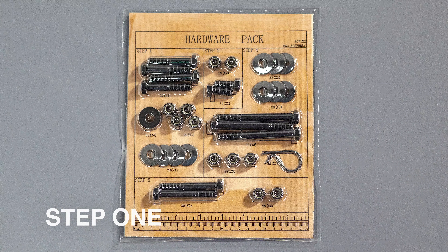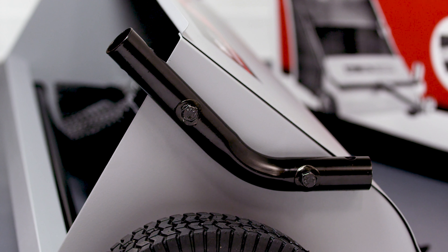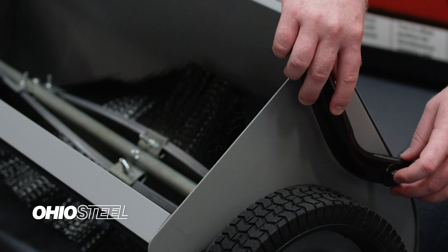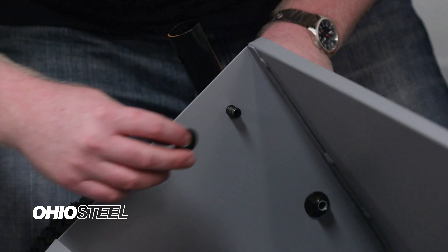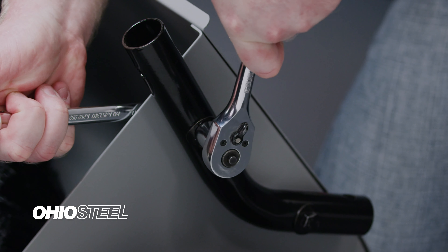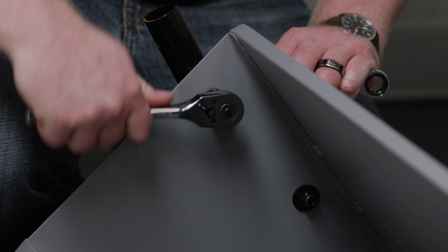Step 1: Locate the hitch mount tubes in the hardware blister pack. Pop out the following pieces of hardware: four two-inch long hex bolts, four curved washers, the group of four flat washers, and four nylock nuts. Please pay close attention to how the hitch mount tubes are oriented. Take the two-inch bolts and first insert through the curved washer, then through the hitch mount tube, and finally through the holes in the sweeper hood. Notice that the longer portion of the hitch mount tube is pointing to the rear of the lawn sweeper — this orientation is essential to functionality. Now hand thread the nylock nuts onto the two-inch bolts inside the hood assembly. Repeat for the other side. Tighten the hardware but do not over-tighten, as this can crush the hitch mount tubes. The connecting tubes need to be able to slide freely into and out of these tubes later in the assembly.